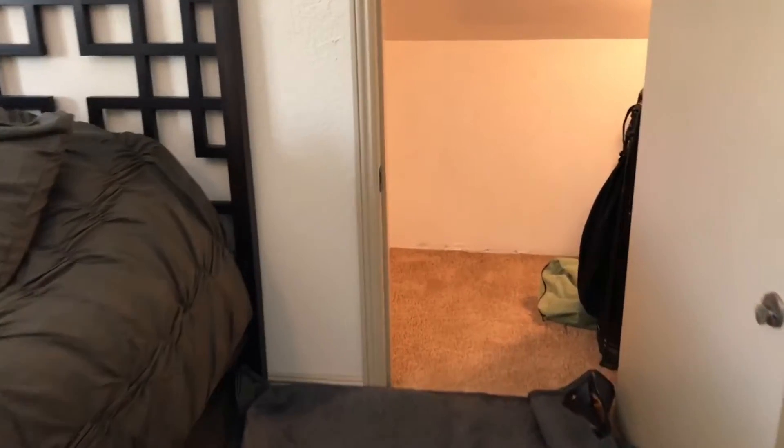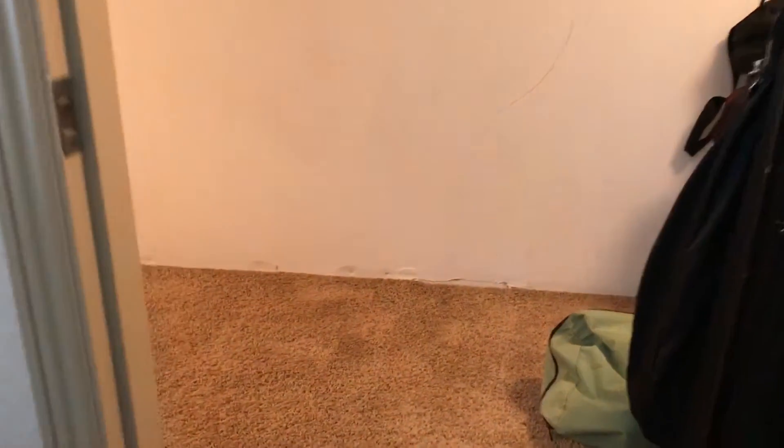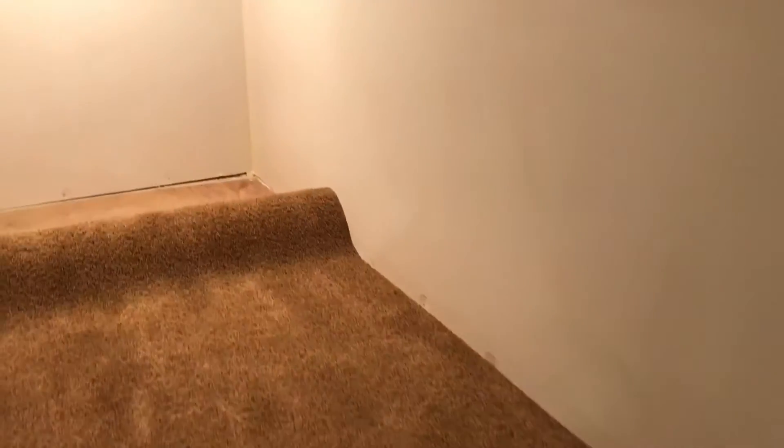It has a metal roof and we are keeping the venting all inside the house as we go up through the ceiling of the main floor. It's going to take us up into a little storage area that's on the second floor and then we're going to be venting up through the roof. Metal roofs are always a little more of a challenge — you have to move carefully, and this roof is about a 6 to 7 in 12 pitch. We've definitely been on steeper metal roofs before but we've also been on shallower pitch roofs.